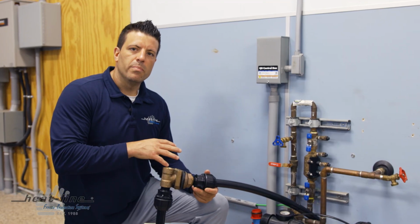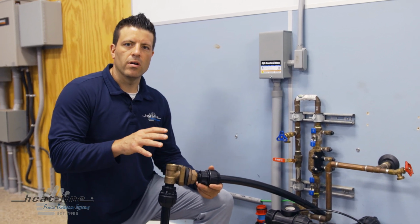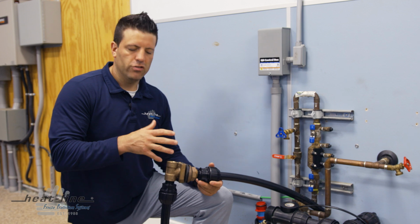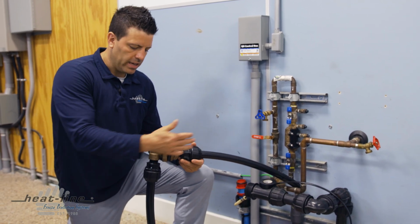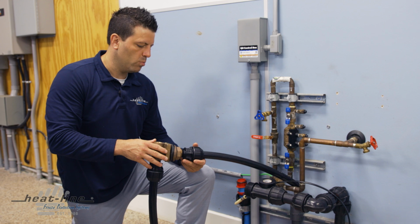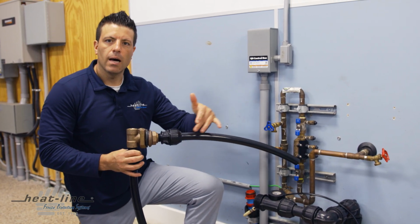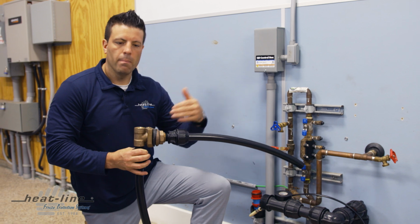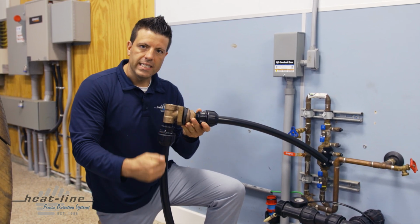So now we're inside the building, and before we start the measuring process, I just want to take you through a little deeper what a pitless adapter actually is. So I have one here in my hand. I've connected a couple pipes to it just to give you the framework of it. This would be the horizontal pipe coming to the well from the building. This would then be the vertical or riser pipe going down the well.